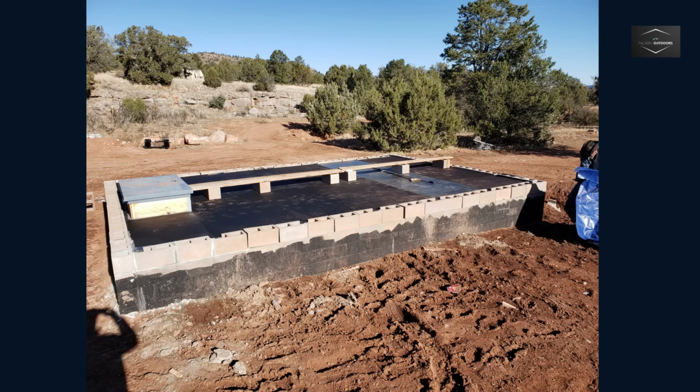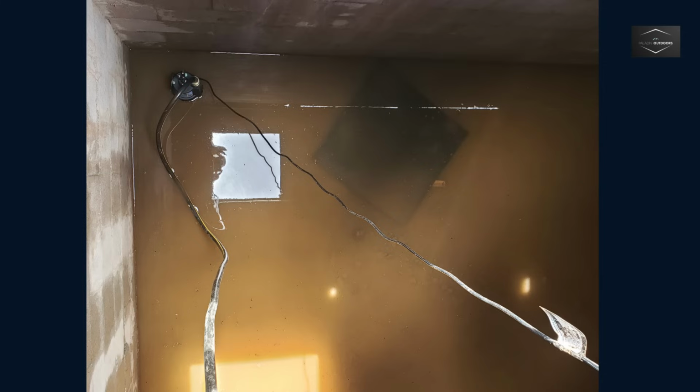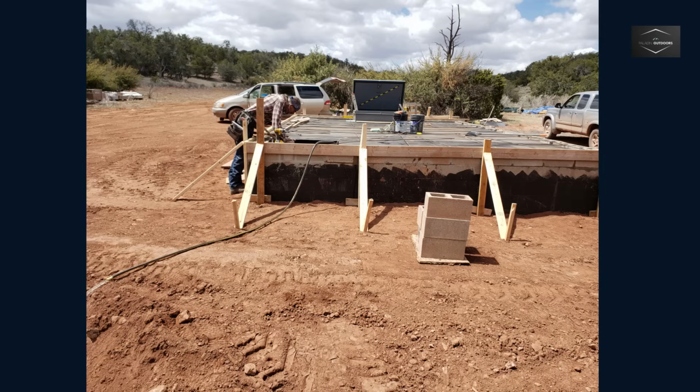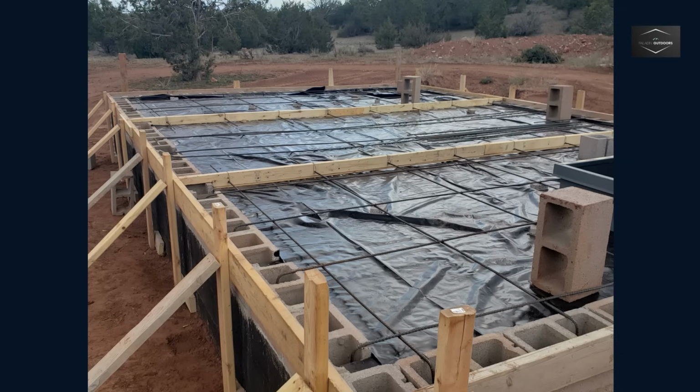When not in use, I covered the structure with a heavy-duty tarp to protect from rain. However, the basement still flooded and I used a submersible water pump to remove the water. Next, I applied a layer of asphalt emulsion. In retrospect, Rust-Oleum Rusty Metal exterior oil-based primer would have been a better choice, although more expensive.